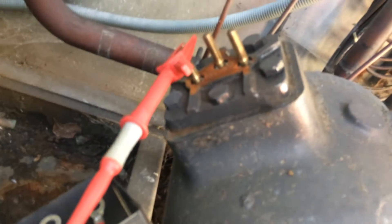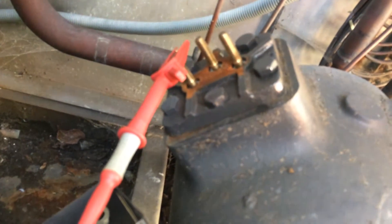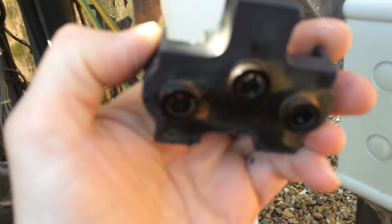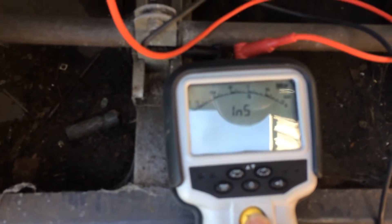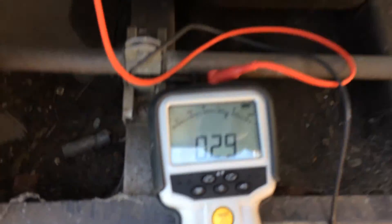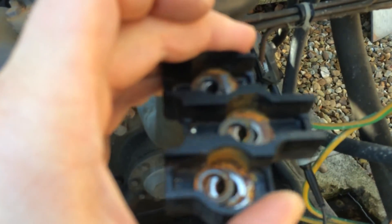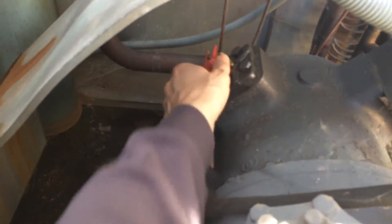Alright, we've took the plastic insulating terminal plate off and I don't think there's any rust making any tracks now. They could have been - actually that was rusty. Definitely the motor. Sometimes that rust on there is enough for it to short through - a little track across there, just like the ignition on your old cars, on your old distributor caps - it can track through.